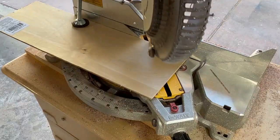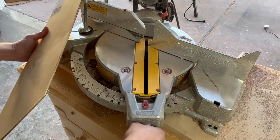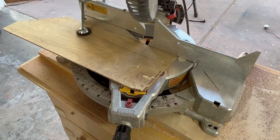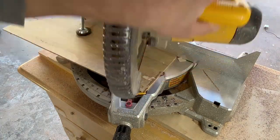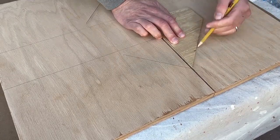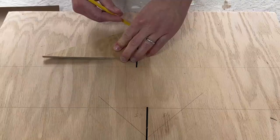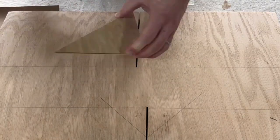So as you see here, I've divided essentially the sled in two parts. And to make sure that the lines where I'm supposed to place the handles are perfect, I'm cutting the angles with my miter saw at 45 and at 22. As you see, I have samples here from the cuts made with the miter saw, and these worked very well for me.